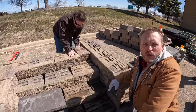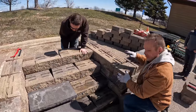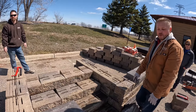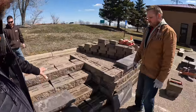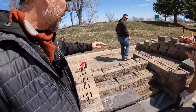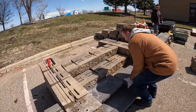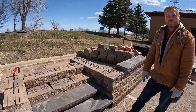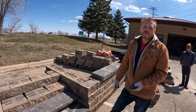In the field, I recommend building one wall first, then your pedestal, then the next wall — that way you can butt the wall up tight to the block rather than trying to pinch blocks together. When you have multiple pedestals for taller stairs, I did it at my own house: I built the primary pyramid staircase, backfilled with gravel, compacted it, built a second pyramid on top, and connected the pyramids together. My staircase is over 20 years old and has never changed. It's a simple, solid way to build a staircase using these blocks.